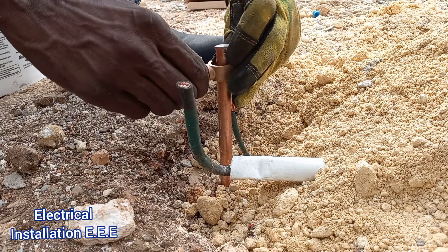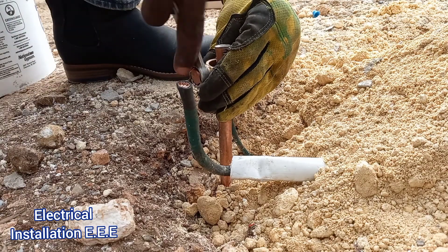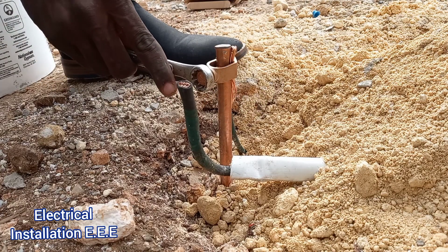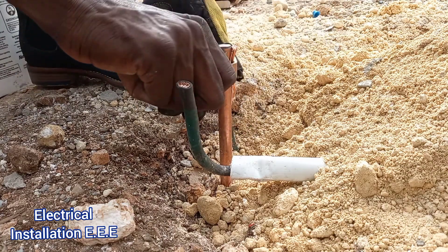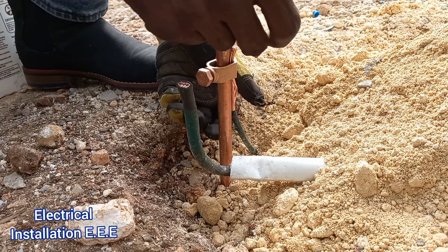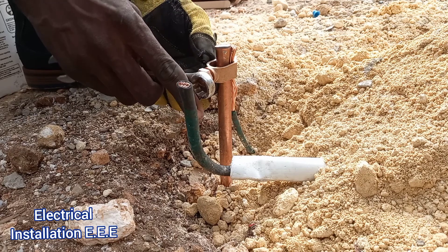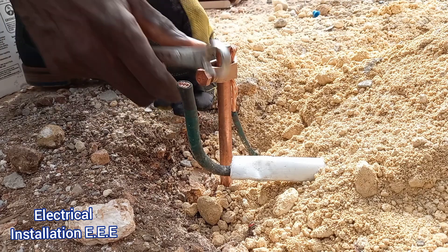As you can see, there's a bit more body inside of it now. I'm starting to feel it — and now it's tight. It's very important whenever you're earthing smaller gauge wires that you make a bend on it to get more body into it, so you don't have to tighten it all the way down to the point where it breaks off. Because it can easily break off if you apply too much tightening, and for earthing it has to be tight.